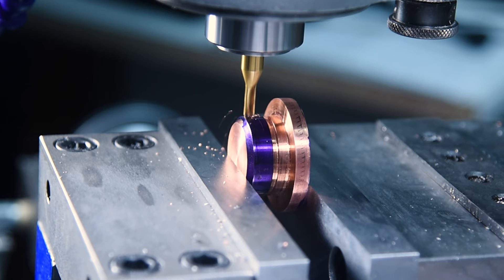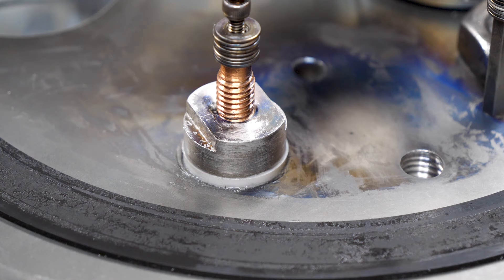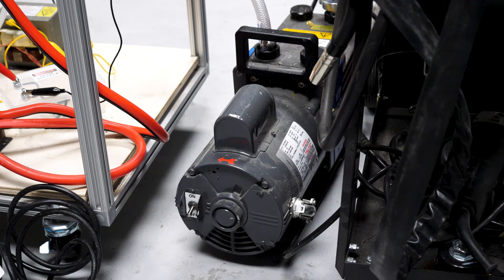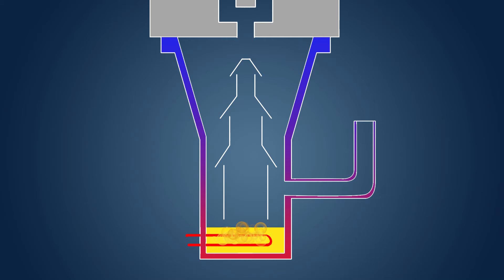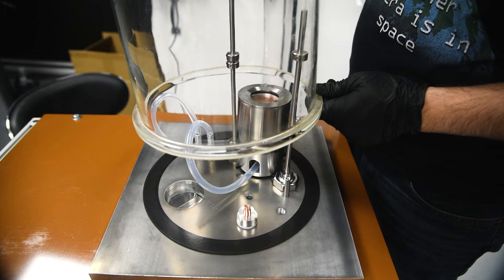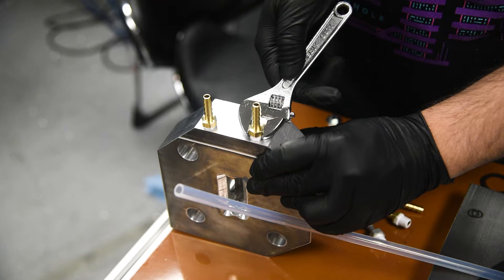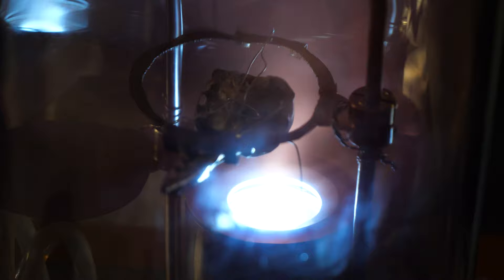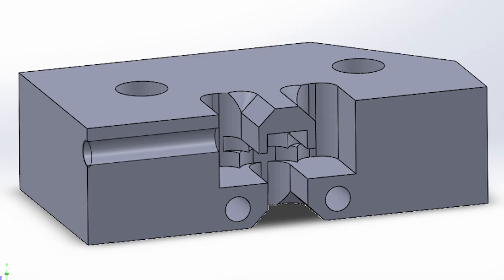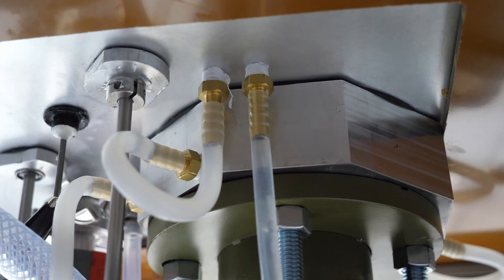A lot of the most complex work centered around four assemblies: the sputter head, the diffusion pump baffle, the high current feedthrough, and the rotary couplings. The vacuum pumping system is broken into two main pieces — a mechanical pump and a diffusion pump. The diffusion pump takes an already moderate vacuum pressure and drops it far lower. It works by boiling oil creatively, but one side effect is that sometimes oil will fly too high up in the column and end up in the main vacuum chamber, which would be very bad. This water-cooled baffle is there to prevent that.